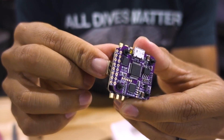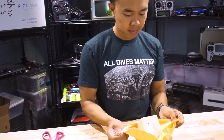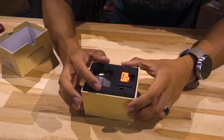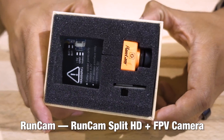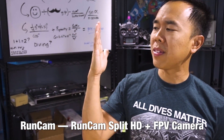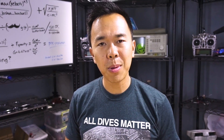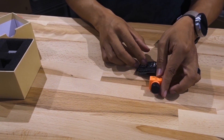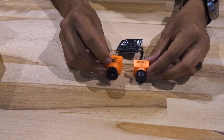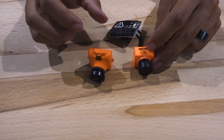All you've got to do is connect your lipo pads, and then you've got your respective motor wire pads on each end. Those guys at Runcam are just killing it, coming out with new stuff pretty much on the regular. This is something I've been looking forward to — in my opinion, a very much needed product in the FPV community. We've got an FPV camera, and then we've got the GoPro Session, at least for freestylers that like to record. Why can't you just have one camera that does it all? Well, this does. So let's take a normal Runcam Swift — this is the Runcam Split. As you can see, it's a lot smaller because all of the processing guts are right here.